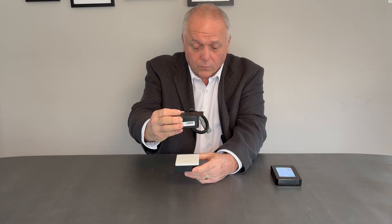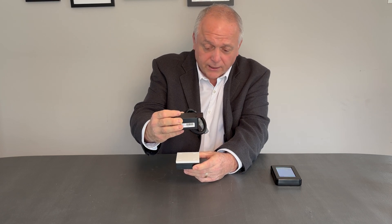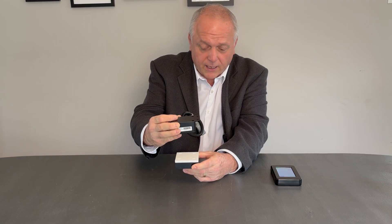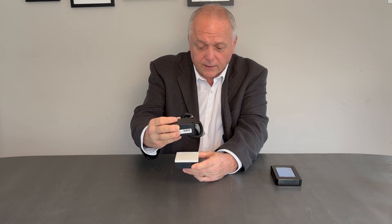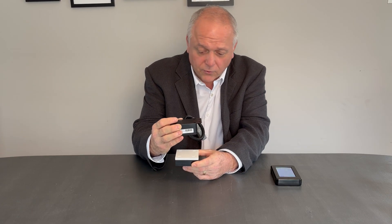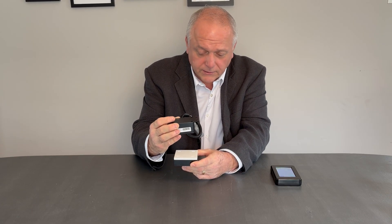When you're loading, we put these on parabolic spring suspensions, front axle, drive axle suspensions, trailer suspensions, and there are no moving parts on this. This sensor is not like a transducer, air transducer, strain gauge, or load cell. There's no wear and tear, no moving parts in this system whatsoever.